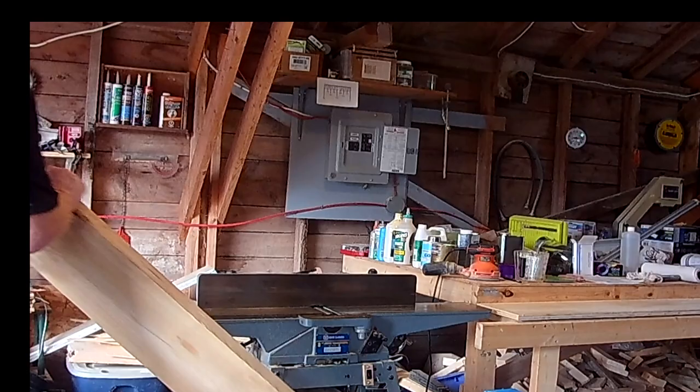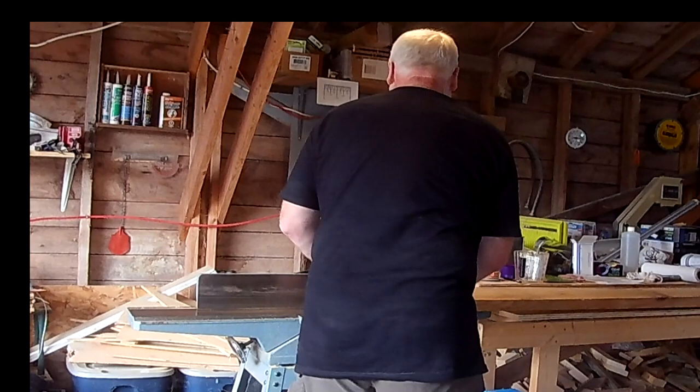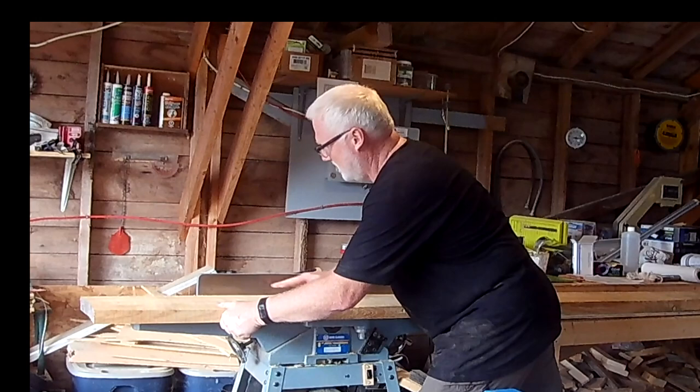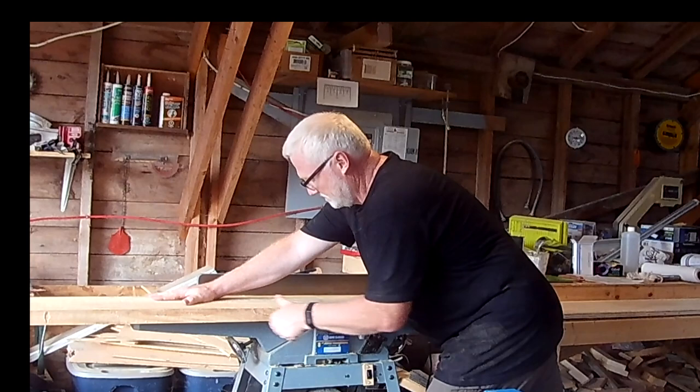Milling down 10 and 12 foot lengths of timbers is a special kind of fun, especially when your jointer measures 6 inches in width. The cut width was set at 5 inches, and typically after each pass, the timber would be flipped around so that the side outside the blades on the first pass would then be cut. Most of the time, this left a roughly equally cut 9-inch face.